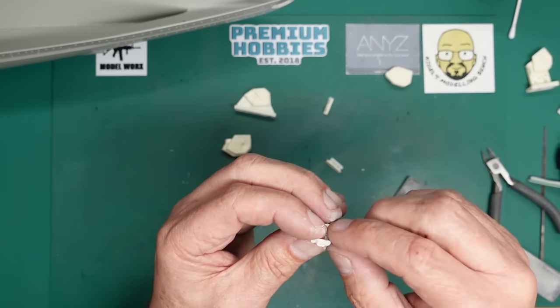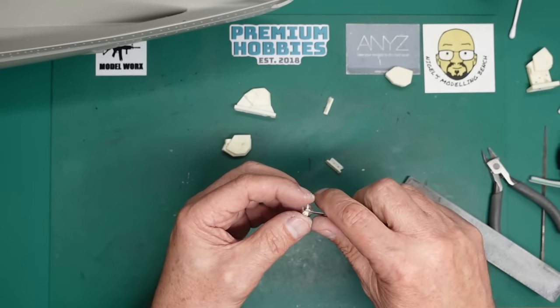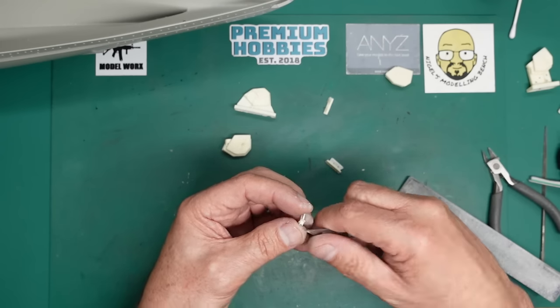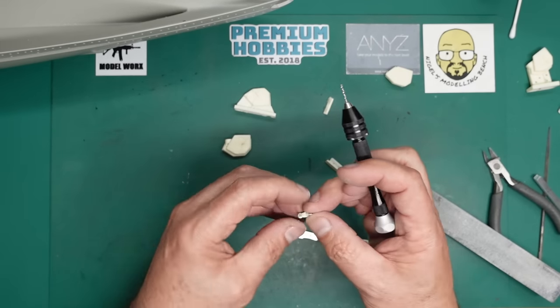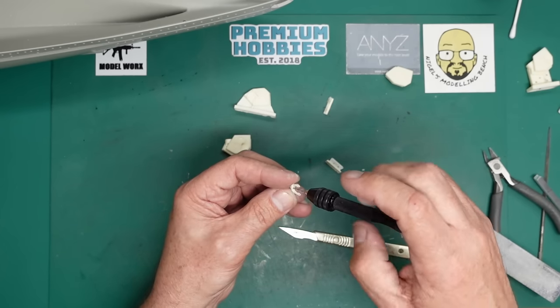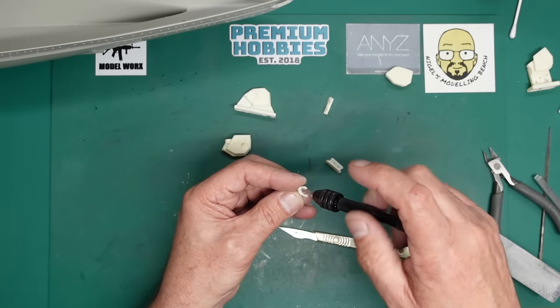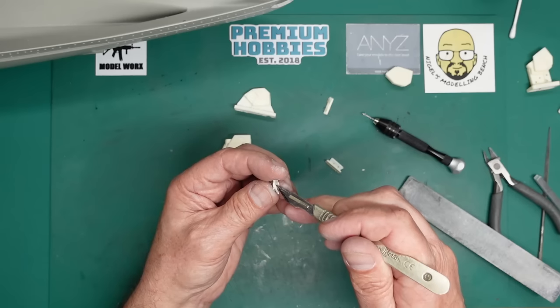You can see in the middle - to mold it, I had to mold it blanked. I couldn't put a hole through it, well I could have but it made life a lot harder. So I've got a 1mm drill here - I'm just going to come in from the other side and gently drill through there, not pushing very hard.